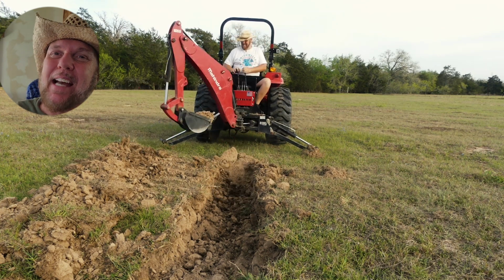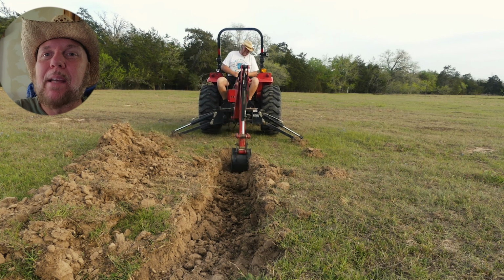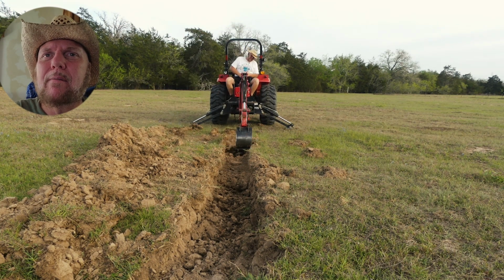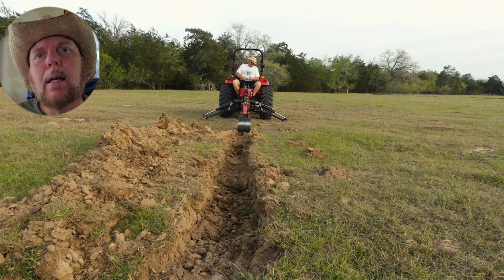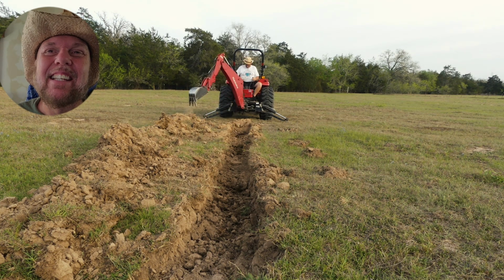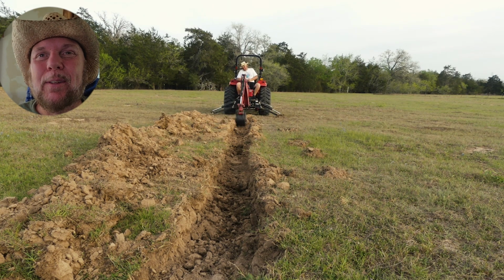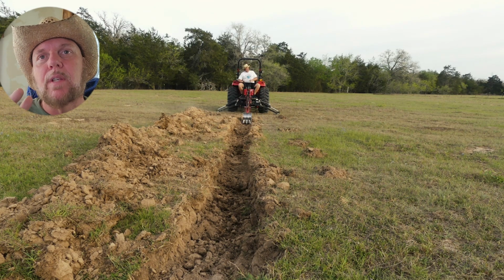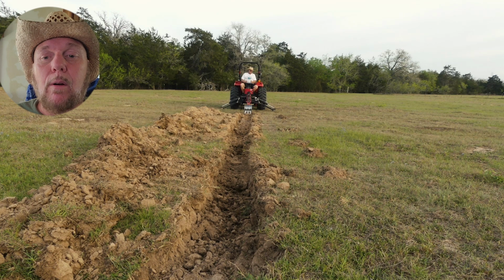I'm just cutting through the topsoil, which is pretty loamy, sandy loam. But I'm hitting clay right away, 12 inches down. This is about 75 feet in as I move through. I'm pretty excited to dig this little test spot. And I go right through all of the green areas and get to where I threw that one thing and it tumbled, a piece of clay, and it tumbled. So the outriggers, I'm double outriggering now because of two things. I'm digging the pond, but also I'm hitting clay right away, which just pulls that poor little tractor around.